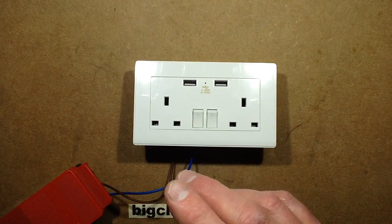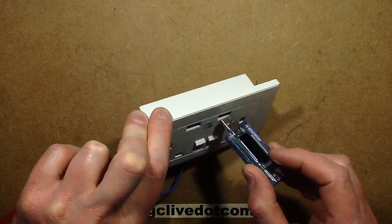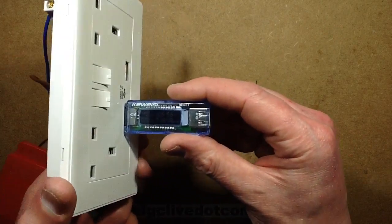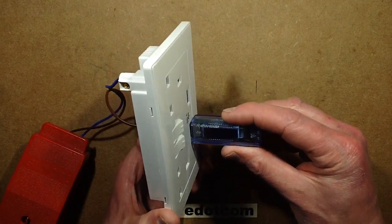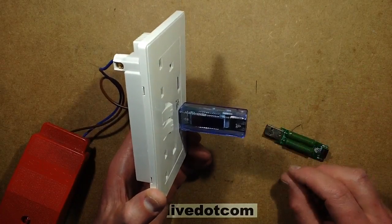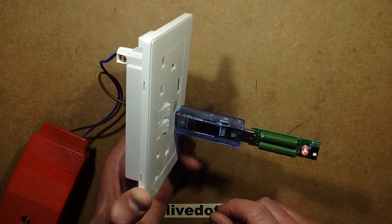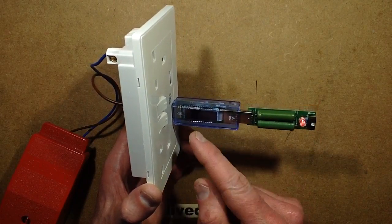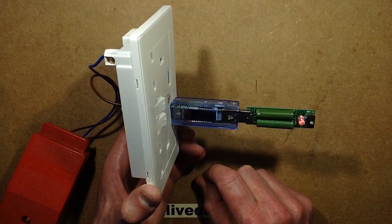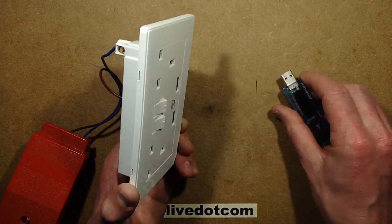If I plug in a meter - it's currently displaying 4.9 volts, just bouncing around 4.89, 4.92 - it's not quite 5 volts. Then you plug a load into it - this is a 1 amp load - and it jumps up to 5.01 volts. It seems to stabilise it. And it's showing the load is drawing 870mA. So best part of 900mA from a 1 amp load - that's good enough. It certainly seems to put out rated current.